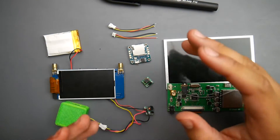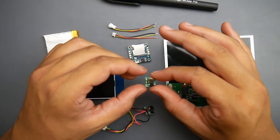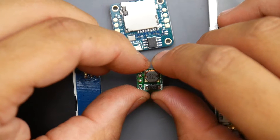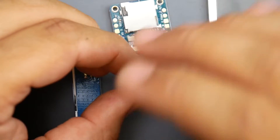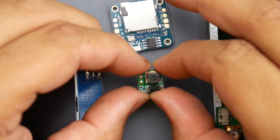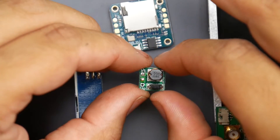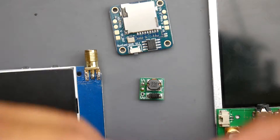Next thing, and something that's very, very important to have — even just to keep a couple around — is one of these. Now, be careful when purchasing these. They come in many different types of flavors. One of them can take a 1.5 volt output and change it to 3.3. One could take a 3.3 and change it to 1.5. There's a lot of them. However, the one we need is 3.3 to 5 volts. It's very important because there is no 5 volt regulator on any of these, and we need to step up the 3.3 volts or the battery voltage to a stable 5 volts for the Runcam DVR.